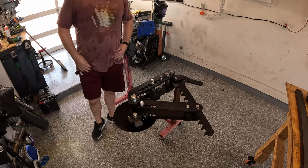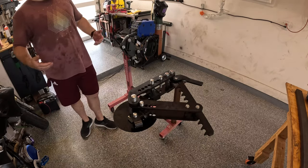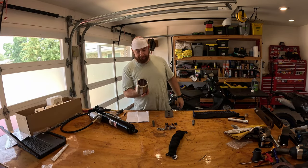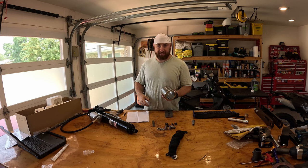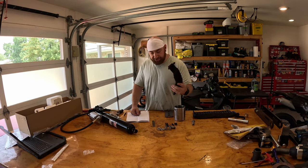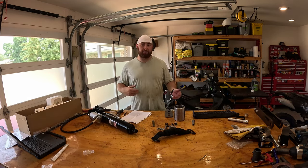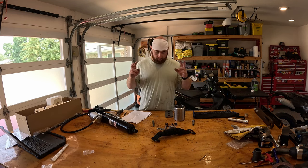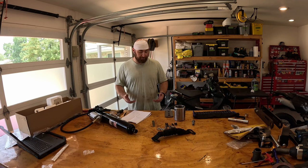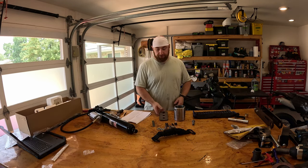The next step is installing the hydraulic conversion. Swag actually sells two kits - I went with the machined version. It's a little more expensive but it comes with a bungee strap and a few other bits that in my opinion make it the same price as the lower-end kit but better value. To install this you have to disassemble your tubing bender. Swag recommends assembling on a workbench but I'm going to do it on the stand after reinforcing it. They send a really thorough set of color instructions with wonderful photos, including things like a die cast release pressure knob.